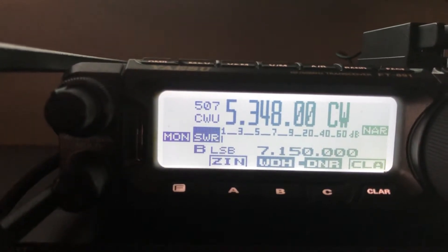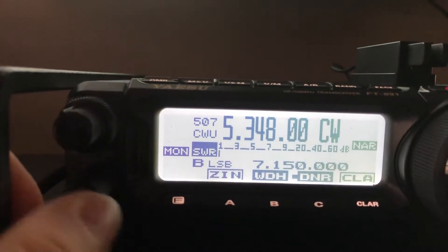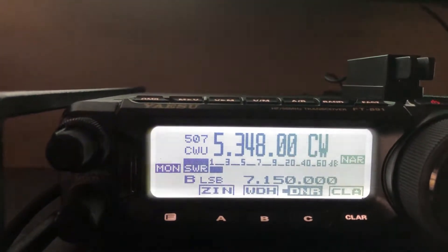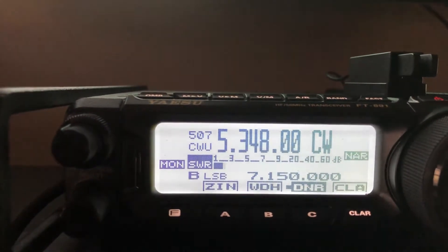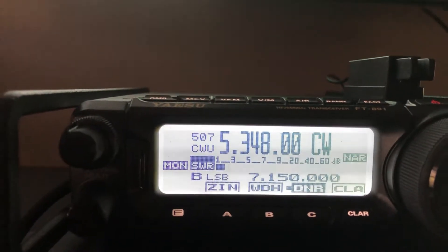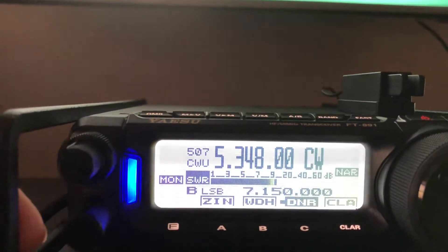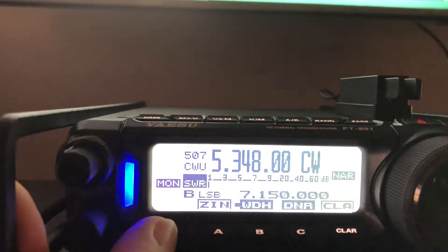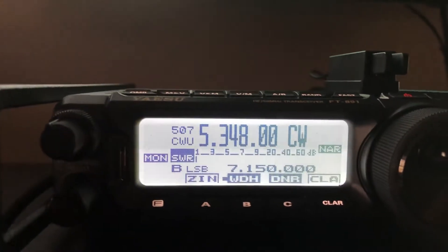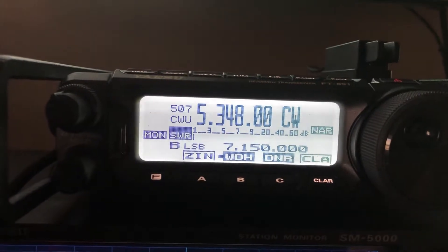Not even wiggling the meter. When you turn off all this filtering, you're sending more signal into the AGC, and the AGC is driving the meter. So you could argue that technically he's probably an S2, maybe an S1, because he's right in there with the noise. When you tighten your filter, it lowers the amount of voltage that the AGC is sending to the S-meter. Ignore the S-meter — go by signal-to-noise ratio.